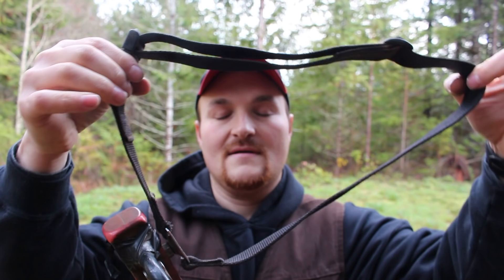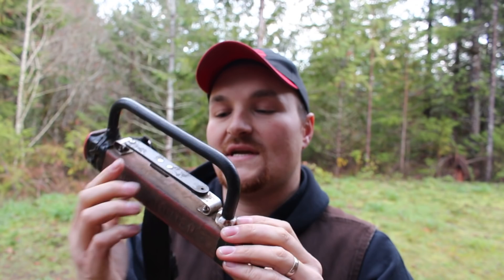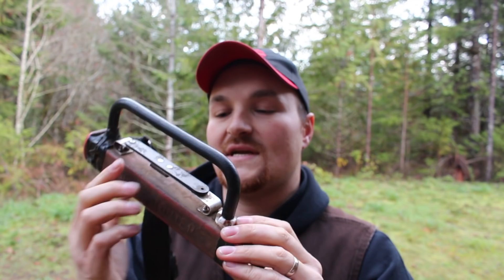So how this works: it's got a nylon belt and it's worn on the rigging slinger's side. I wear it on my left; some people wear it on their right — it doesn't really matter. It has an antenna and a microphone on the end for talking to the yarder engineer. When held down you press it and talk into the bottom. When you hold it upright, the mercury switch is engaged and you get whistles. Pretty simple.